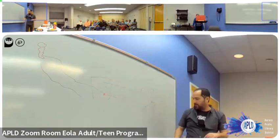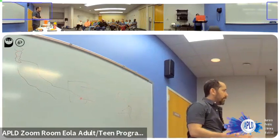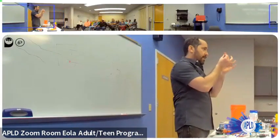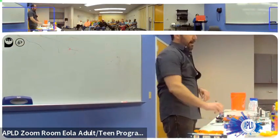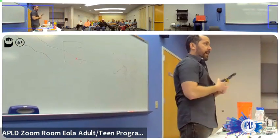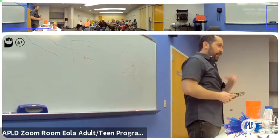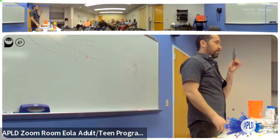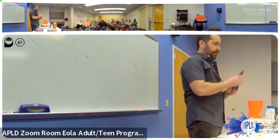My advice would be to turn off all the power, get two new three-way switches, and replace them both. And when you are replacing it, check any wire nuts, okay? What you want to do is take the old wire nut off. Ideally, get yourself a pair of these, like the linemen's. Take the old wire nut off and retwist all the wires, okay? If any of them look burnt and corroded or anything like that, use wire strippers, cut a new end, peel the insulation off. The gauge for the wire is marked right there, okay?